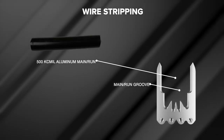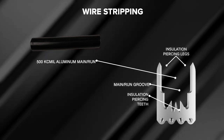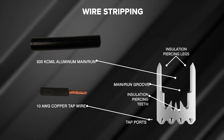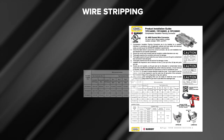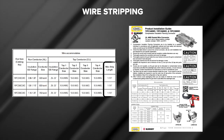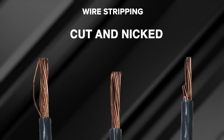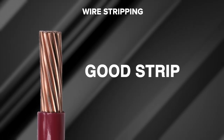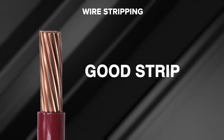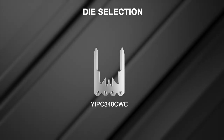Chapter three: proper wire stripping. The main run trunk wire does not require wire stripping, as the connector is designed with insulation pierce features. The tap wires require insulation stripping to ensure optimal electrical and mechanical performance. Proper wire strip length is identified in the installation instructions provided with the product and the sales drawing or master catalog. When stripping, be careful to avoid cutting or nicking wire strands, as damaged strands can affect the integrity of the connection both electrically and mechanically.